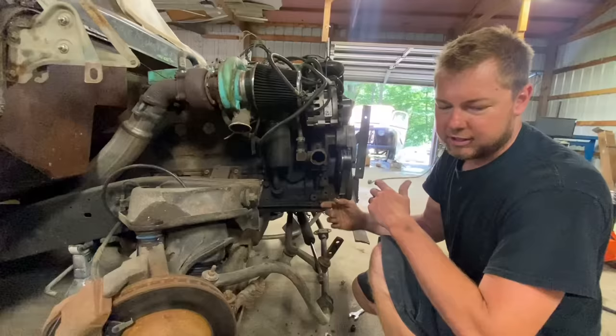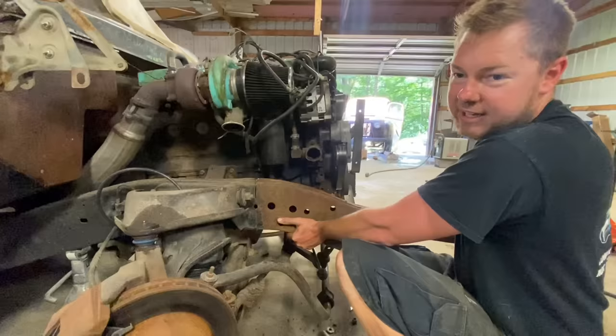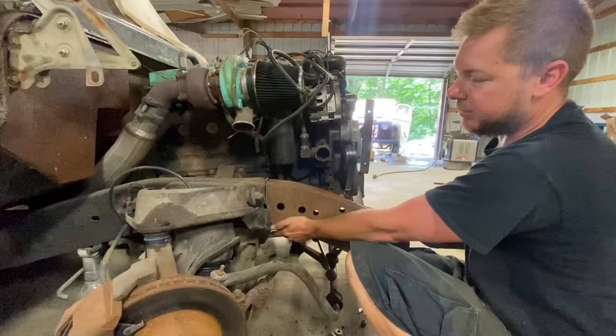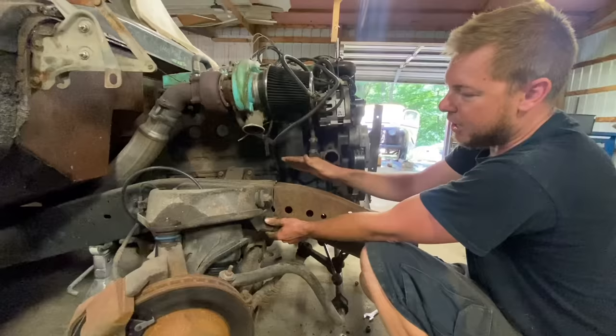There's no weight on the front of this truck, so you could probably get by with just welding that up, but that's not how we're going to do it, because like I said, if it was ever in a wreck, it could easily snap this way. So we're going to sleeve it inside here and even drill some plug holes in it so we can plug weld that plate in there, and everything will be better than ever. If this truck was hit, if the truck was bent back here further, we'd have to put a frame under it. I guess you could section it, but this is probably about all I would do